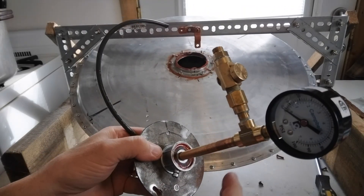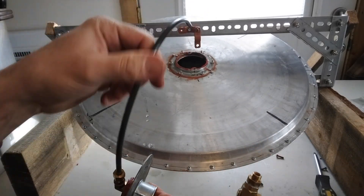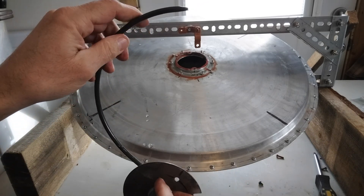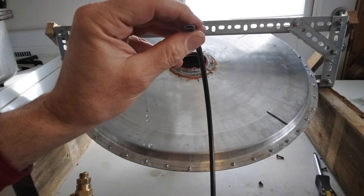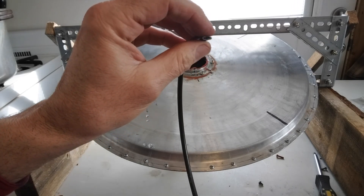While I have this turbine apart, I'll show some more details. This is that nozzle arm. This is a quarter inch brake line. On the end here, I flatten that down a little bit so it's just a slot that the steam will spray out. So it's restricted.